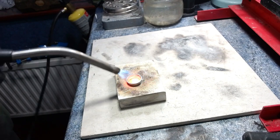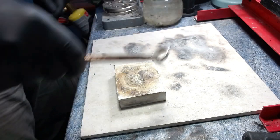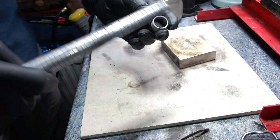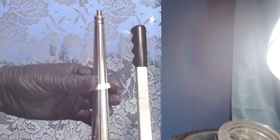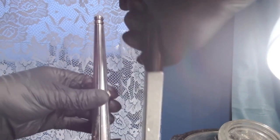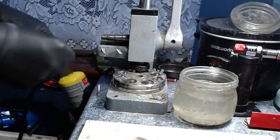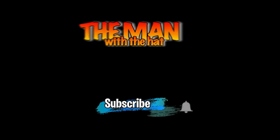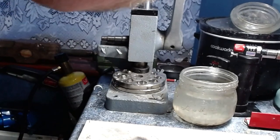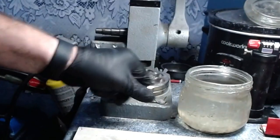The first and second stages of folding are done, with re-annealing in between. Now it's ready for final shaping. Alan wanted a size U, so I've got to go three sizes bigger using my ring stretcher — turning it a quarter turn each time to keep an even stretch. For the free coin ring, once you've chosen three coins to send, contact me first so we can go through the details and confirm the right coin for the ring size you want.